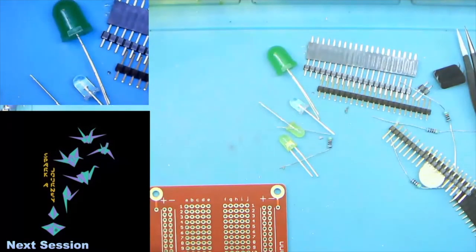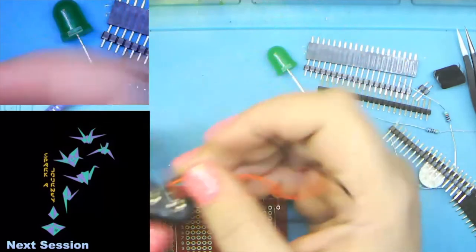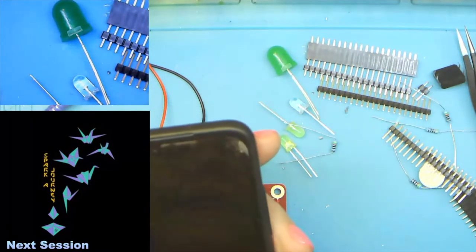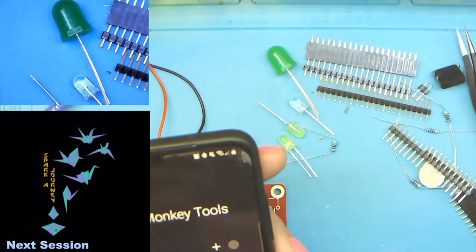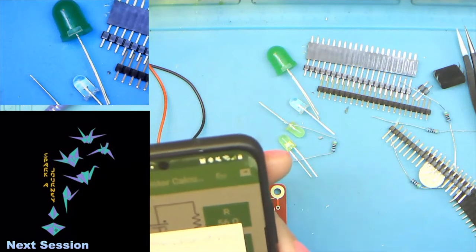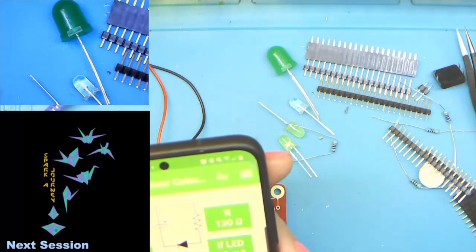Let's see. If anyone has any questions, let's build a random thing. This is a 3 AAA battery holder, so it's going to put out about 4.5 volts. So how many LEDs can Chris put in parallel and make a cheesy flashlight? Ta-da. Five. Yeah, let's start putting it in. Five done.